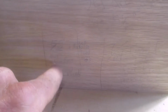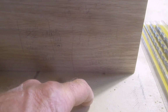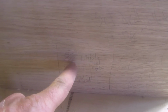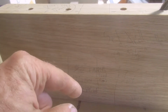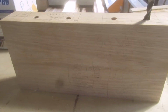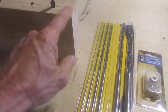whichever one of these is smaller, 5/32 or 7/64, in the workpiece that I was clamping, to make sure that I was only removing the inner diameter of the thread, so I would have threading material, and I would send the drill through the other piece where the pocket hole was. I would drill it a little bit larger than the thread, so I wouldn't be threading into both pieces, only the one I wanted to pull towards the clamping one. So I would have to use the small one to make my larger hole through the workpiece, right?